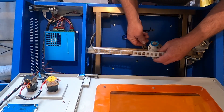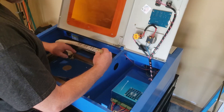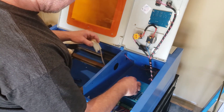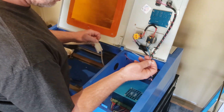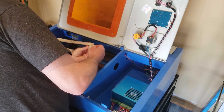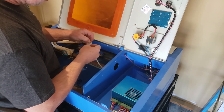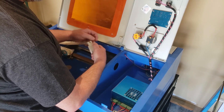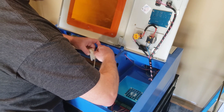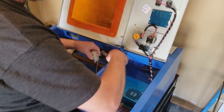You can hook your air assist line up and then remove the slack so it's not flopping around in there a lot. On the end of this piece here, there's a couple of holes for a cable tie — just thread that cable tie through there and bring it back through the other one. You don't want to do this up really tight because you don't want to pinch that airline. You just want to hold it down out of the way so it's not hitting the side of the frame. I'm just going to clip that off.